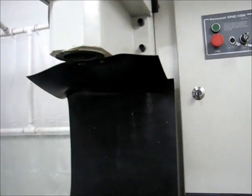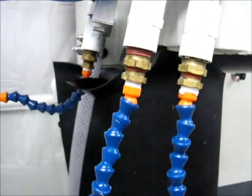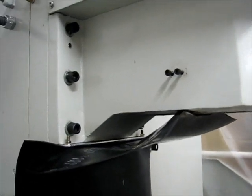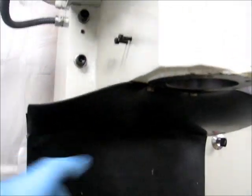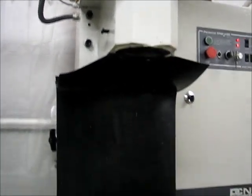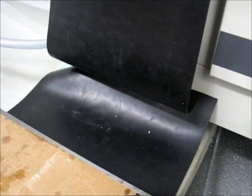The Z-axis cover is in place fully now, as well as the under-head flap that I thought would be a good idea — still not convinced it is or isn't a good idea. It certainly needs some trimming; my coolant manifold won't fit up here without substantial interference, so it would need to be trimmed back anyway. The idea is it would keep chips and coolant from splashing into the opening in the bottom of the mill. I might be able to pull off the same thing by trimming this piece back substantially on either side, just to keep chips away from direct access.